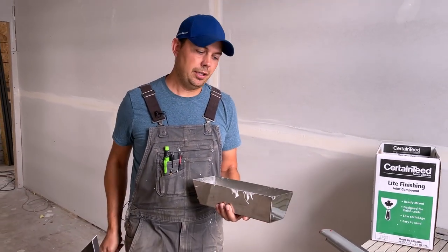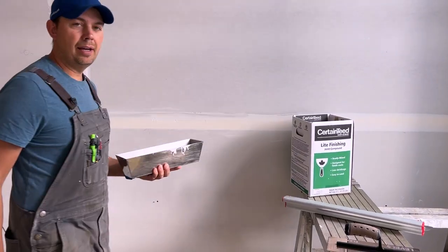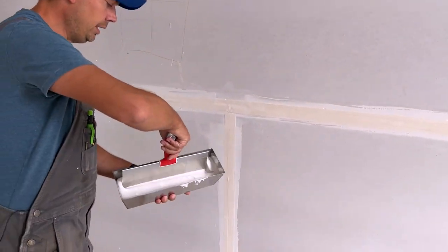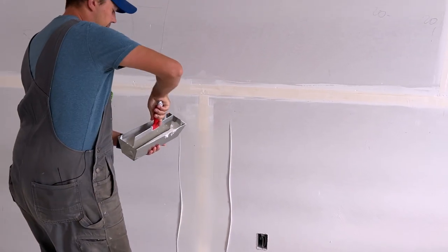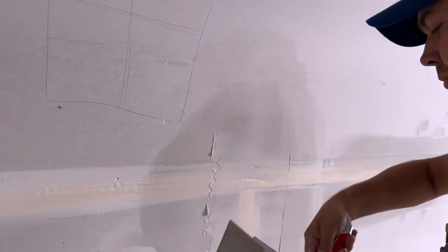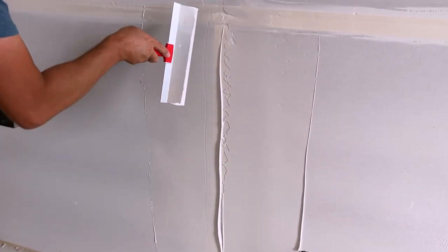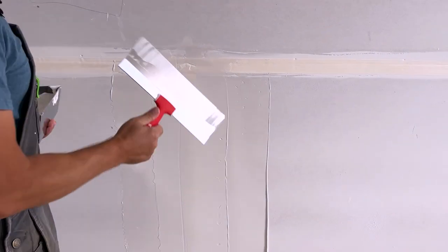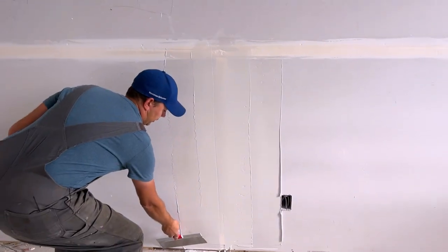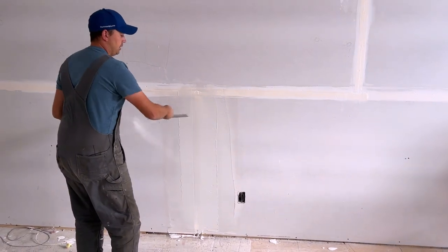First off let's just apply some mud on the wall here. I'll show you how you do it with a 12-inch blade, and then I'll show you how to do it with the level five. This is just a typical butt joint — you just want to take your mud and apply it, get on the wall and go a little wide as well. Now this is just my first coat. You can see this line right here — that's called a hitchhiker. What that is: sometimes you pick up a little piece of dust and it makes a line all the way up. So you want to avoid those.